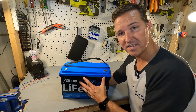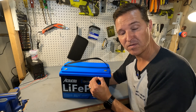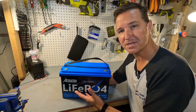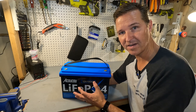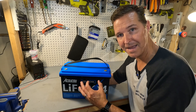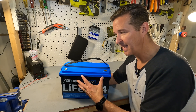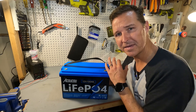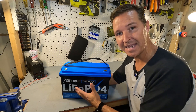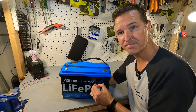It says that you should charge it at 20 amps with a max charge rate of 50 amps, and the discharge rate — lithium iron phosphate is typically around 20 amps — but they do say you can discharge this at 100 amps max continuous. We're going to be testing that, and we'll also see how high we can push it because nowhere in the documentation or on the website does it say what the maximum amperage load is. We're going to try to push 200 to 300 amps out of this thing to see if it'll shut off.